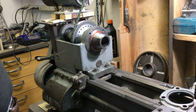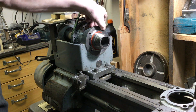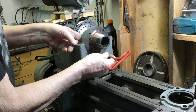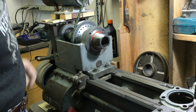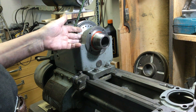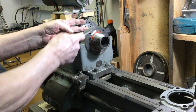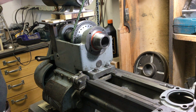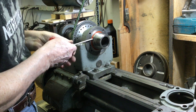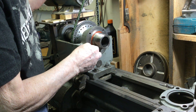I'm pretty sure I'm going to have to do some measuring to find out, but I'm pretty sure this casting is uniform thickness from the top down to the bottom. If not, I may have to use an extra long milling cutter to face off the back of this casting so that it is uniform thickness, because the new Timken bearing or tapered roller bearing that I want to put in here does not have this groove in it for the snap ring.